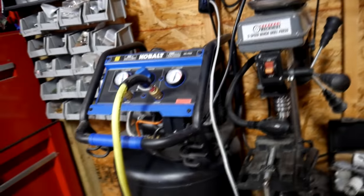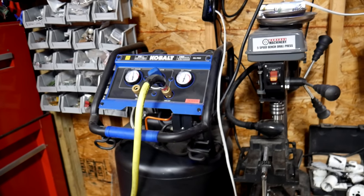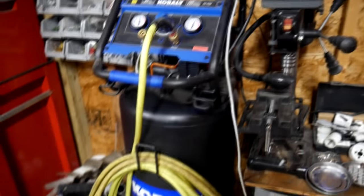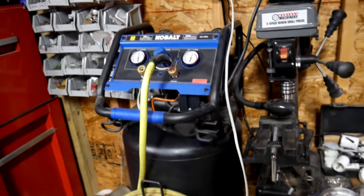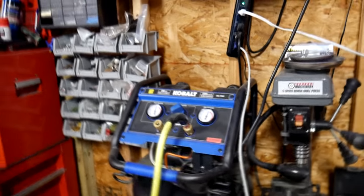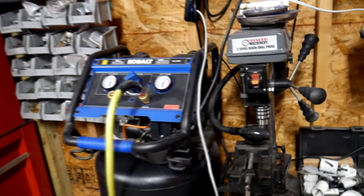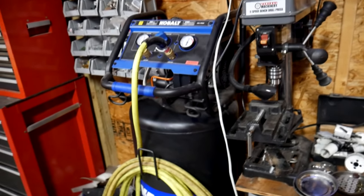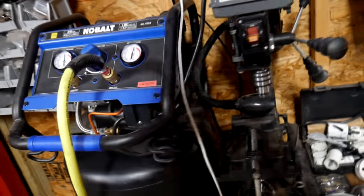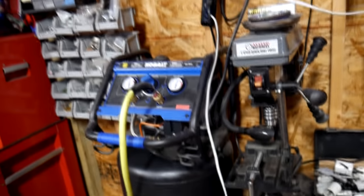I highly vouch for this compressor. At one point I had the Campbell Hausfeld hot dog air compressor — eight gallons, 125 or 150 PSI — which was also a really good compressor and actually quieter than this one, around under 60 decibels. However, it alone took about five minutes to fill up even at only eight gallons, and when using pneumatic tools you'd be filling it up the entire time. With this 26-gallon unit you can use most pneumatic tools for a minute or so before it even starts filling, and it fills up fast enough that it can finish during tool use.